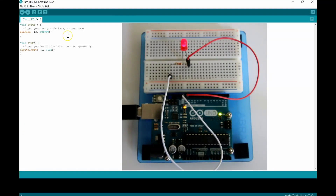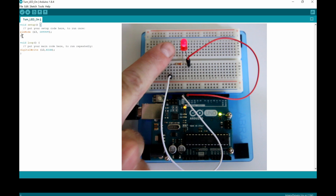Here's our program from the previous video where we set the pin mode and said that pin 13 was going to be an output. Remember that in the void setup, these instructions just run once, whereas below in the void loop these run repeatedly — they'll cycle all the way down to the bottom and then start back at the top. Both the void setup and void loop start with an open curly brace and end with a closed curly brace. Right now the LED is high and firing on, and the internal LED for pin 13 is also firing on.